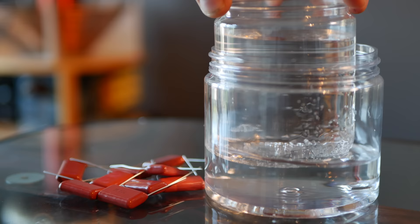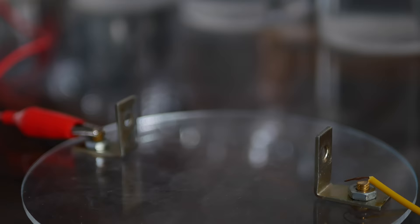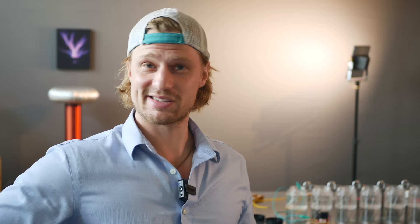This is where that dichotomy of water comes into play. If placed inside a plastic tube, fresh water will act like a high-value resistor — goodbye resistors. And saltwater is really conductive, so separating two bodies of saltwater with a plastic insulator replaces high-voltage capacitors. That leaves only the spark gap left, which is just a gap — not that hard to make. These three things are all that it takes to turn a small high-voltage supply into vicious little bolts of lightning.